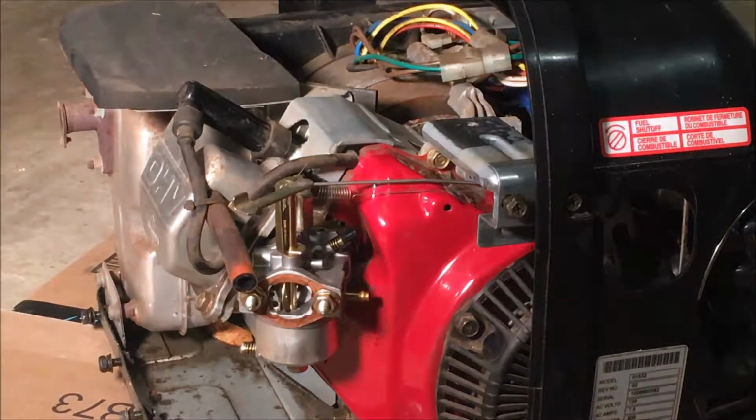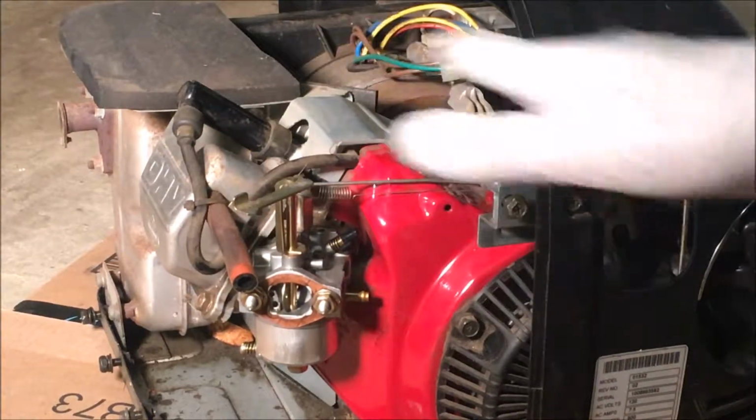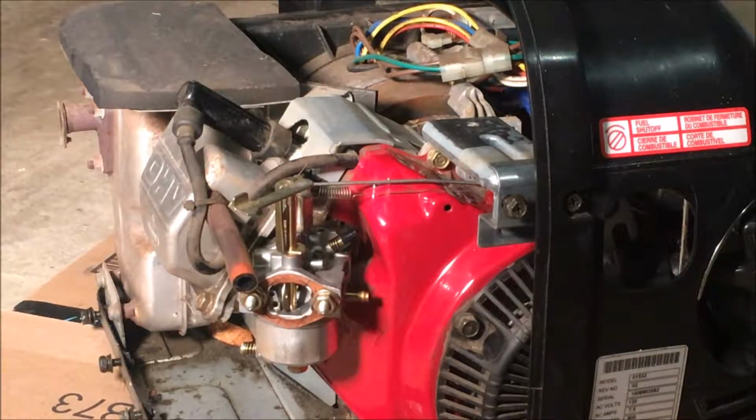One thing worth noting too, the bottom of the fuel tank, because it's in close proximity, has this foil insulation, and for whatever reason there's a seam running down here, and it was starting to peel off the material. So I had some tape that's used for HVAC, like a foil tape, and just ran it along here to keep everything down and in place. You can see this is what it was doing all along here. So anyway, let me probably put the bracket in on the other side, and then I'll set the tank down in and plumb it up to the carburetor.